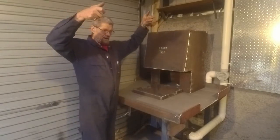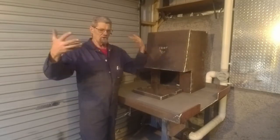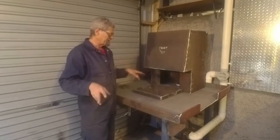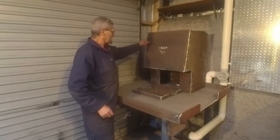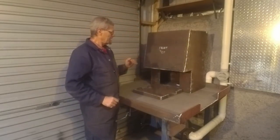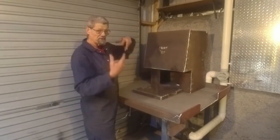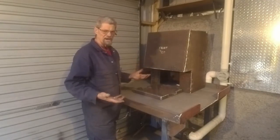the next side, the second side, on, maneuvered it into place, put a bunch of long Irwin clamps on, pulled them into place, got it all into place, tack welded those, pulled all the clamps off, flipped it up, and welded all of the insides. You'll probably see some grinding on here. This is where, when I had welded the insides of one side, put it on its side, and I'm trying to get the pieces in. Once I got the side in, it was far easier to just stick a couple of tack welds on the outside along here to hold it into place so that I could flip it over and weld up the inside, because with all those clamps on it, you really couldn't maneuver it around without knocking the clamps off.